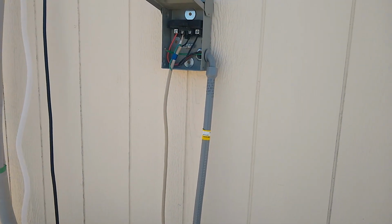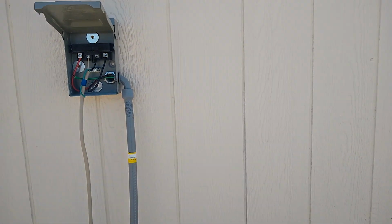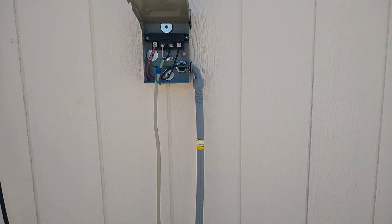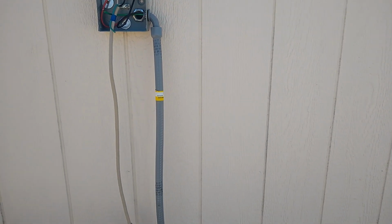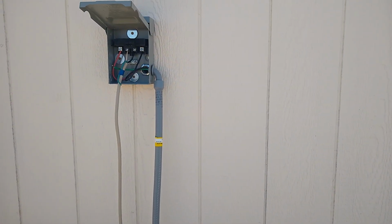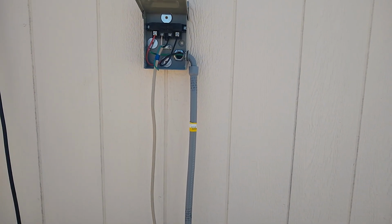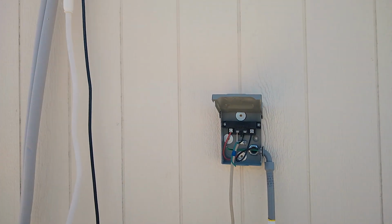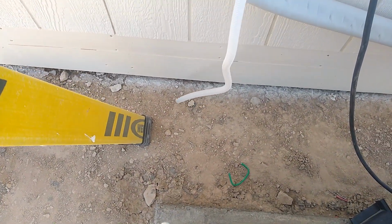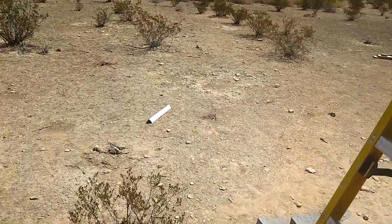So anyway, it's good and it's doing pretty good. I'm going to punch a hole through the wall right here, and I'm going to move this pigtail into that breaker box, and then get things wired up so we've got 240 split phase inside the building, and that'll run the air conditioner and our TV and charge our cell phones, all that kind of stuff. It's great. Even though it's that cool inside the building, we've had like 0 precipitate come out here. So yeah, it's dry. It's like 5% humidity all day now.